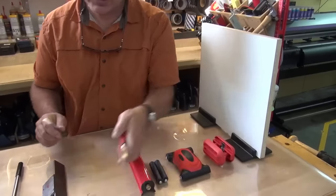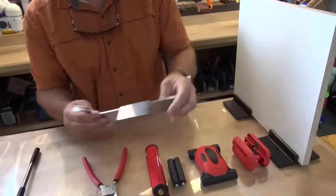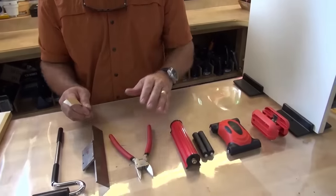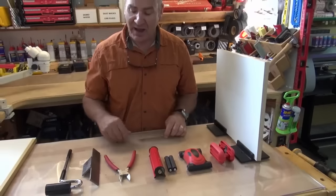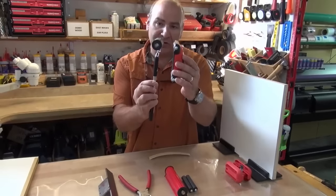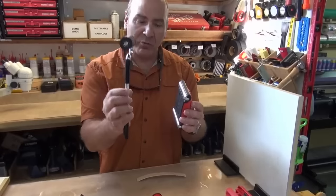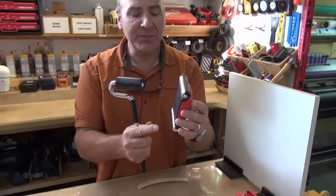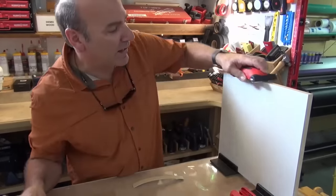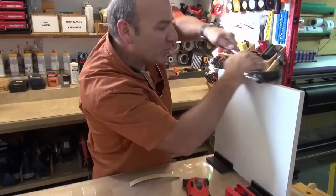And we have the fast accurate seaming tool, or fast tool, which is for seaming fast edge when you're refacing cabinets. Now, people ask, why should I use the speed roller over a J roller? Well, I've been using this for 30 years as a cabinet maker. They work pretty well. But the reason we came up with this is because the speed roller is one-handed operation. The J-roller is two-handed operation. It's much more awkward. It's just more difficult to use.